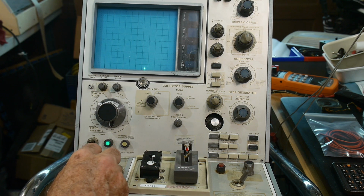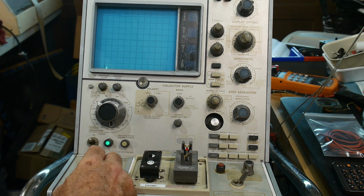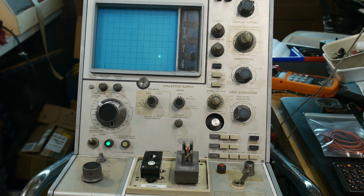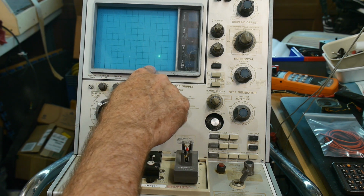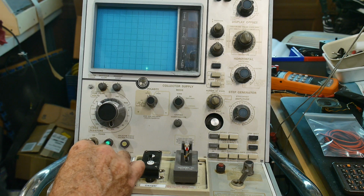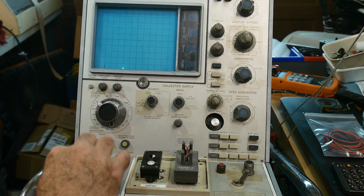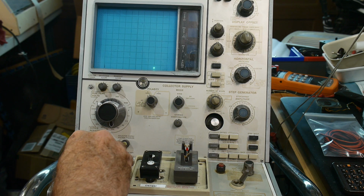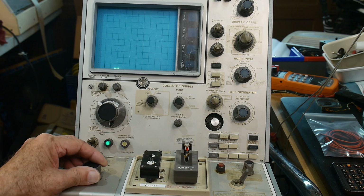Okay. Oh, there we go. Go down here to zero. Takes a while for some capacitor to bleed off. And then as we go up, whoop, there it goes. And so now we're looking at 0.2 volts per division. So 2, 4, 6, 8, 10, 12, 14, 16, 1.6 volts, this would be 1.8. So about 1.7 volt turn on. That's about right for a red LED. So yeah, looking better.